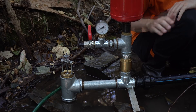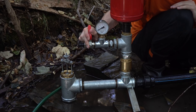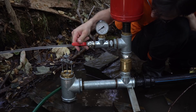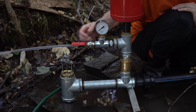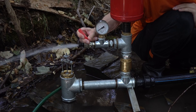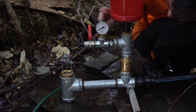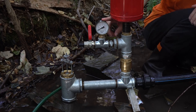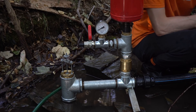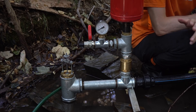Let's check the pressure of the intake pipe. I will open the delivery gate fully — then we have almost no pressure. I will close the gate quite slowly, and we can read on the manometer something below 0.3 bars, which means the head is something below 3 meters — about 2.8 meters.